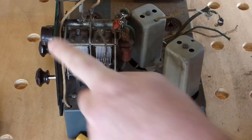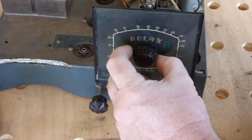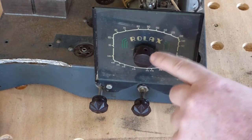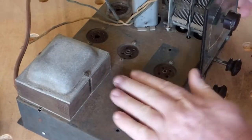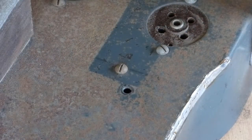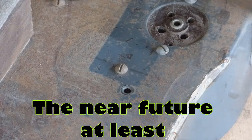This dial will need to come off as well. The knob on here is just a knob and there's a dial pointer which is actually pressed onto the shaft. To get that glass off I'm going to have to get that off the shaft without damaging it so I can put it back on again. The chassis is looking clean now but it's really rough — there's quite a bit of rust and pitting. I'm not going to repaint this chassis. I'm going to have a bit of a scrub with some very fine sandpaper, knock the top of the surface rust off, give it a clean, then maybe put some silicone on a rag and give the chassis a rub to hopefully stop it getting any worse.